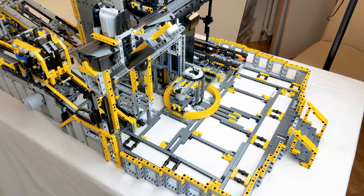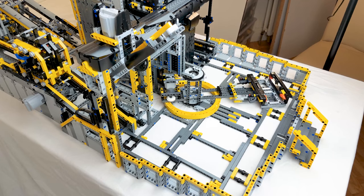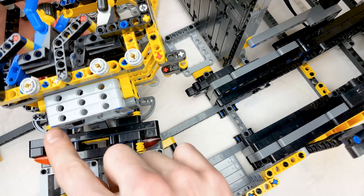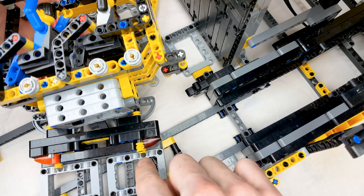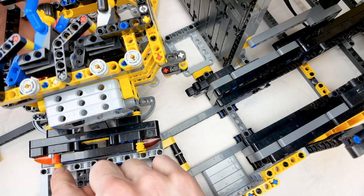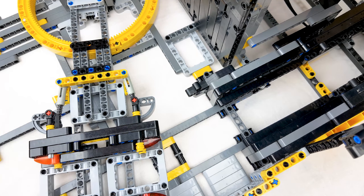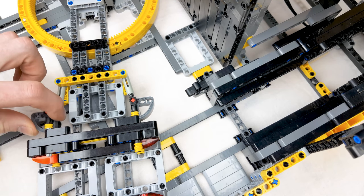Let's start with the half turntable. To keep the card from falling off, three pins with bushings protrude to lock it in place on the carrier. When the carrier reaches either side, the pins are pulled back in by a spring-loaded cam.